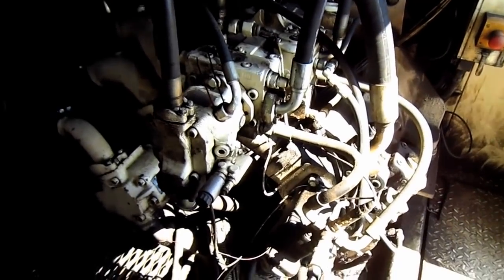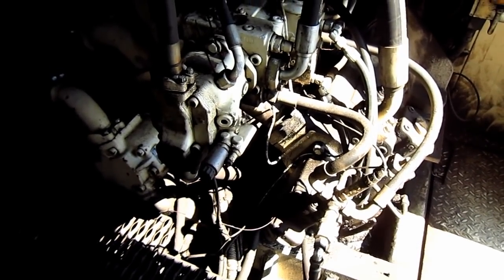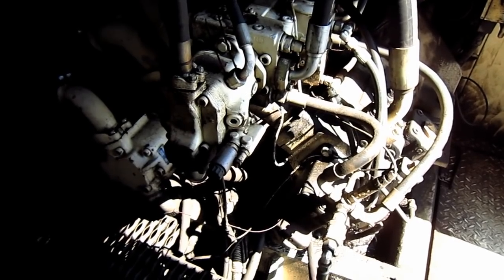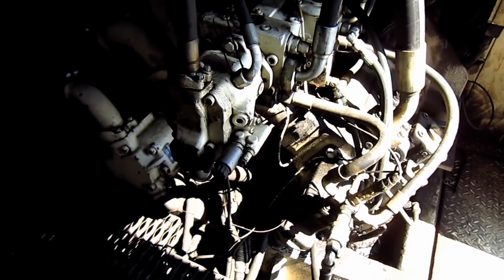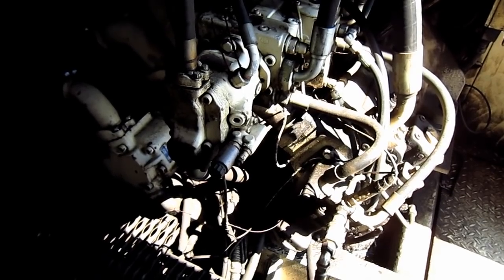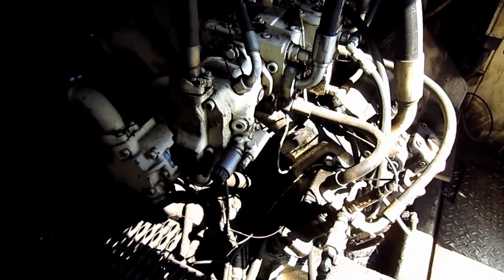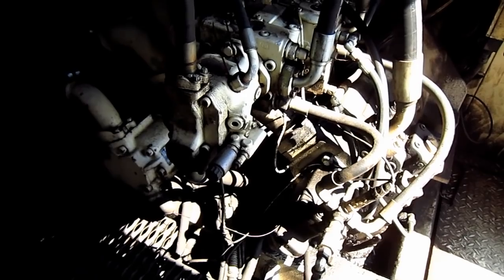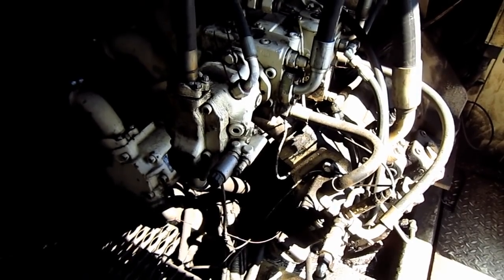Each engine on this machine drives three hydraulic pumps on each pump drive, consisting of two variable displacement swash plate main pumps and one reversible swash plate swing pump. The pumps cross-feed, and the RH120E's pump management system, or PMS, will pull additional oil flow from two or four pumps based on demand from joystick position and load. The PMS continually measures actual values of the engine output and hydraulic system, comparing them with stored target values, permitting improved pump precision, virtually no power loss, lower oil temperatures, and increased fuel savings.